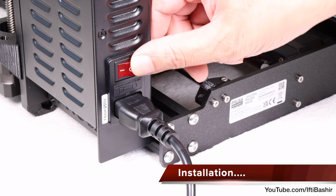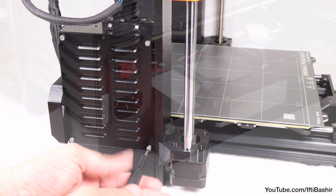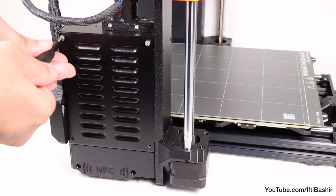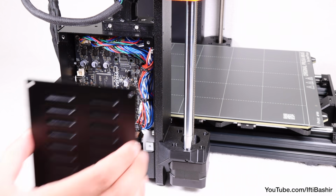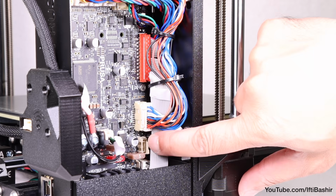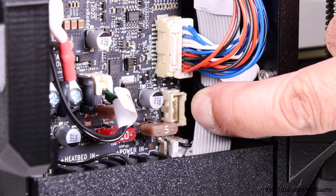Ensure the printer is cold, powered off, and remove the power cable completely. Next, we'll need to loosen the 4 M3 screws holding the metal X-Buddy box cover in position, in order to remove the cover from the printer completely. Looking at the board, we're targeting this connector here, directly next to the bunch of cables that go to the Loveboard attached to the extruder.